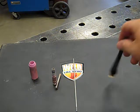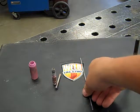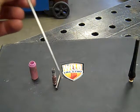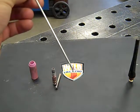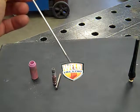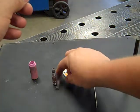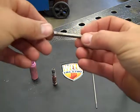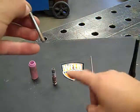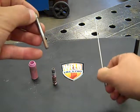Other components are an end cap and a tungsten. You'll see that the tungsten has a color on the end of each one. That identifies what type of tungsten it is. In this case it's ceriated, or gray. We have a collet. Each collet will have a stamped size on it. The stamped size must match your collet body and your tungsten. In this case we are using a 3/32nds tungsten.